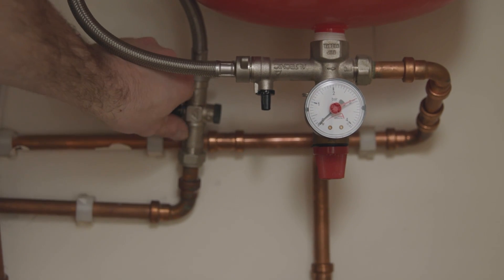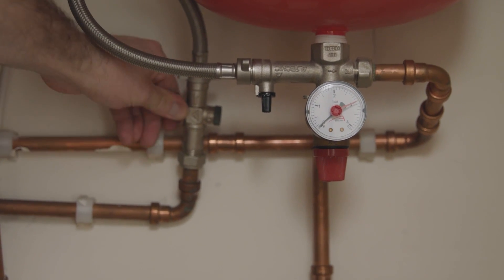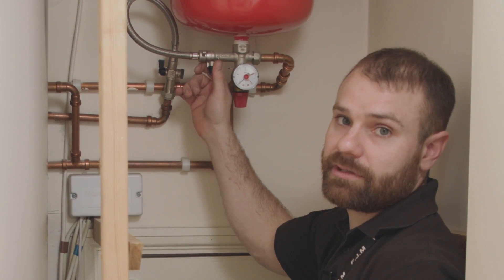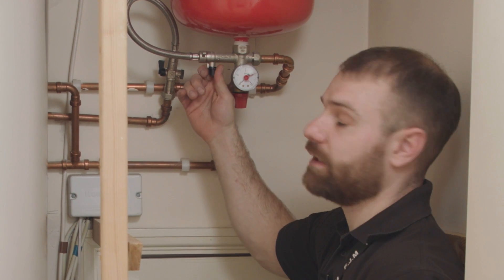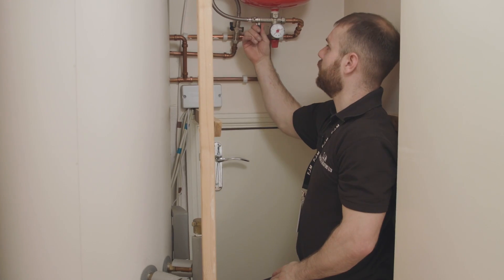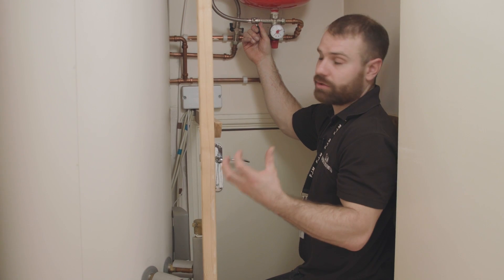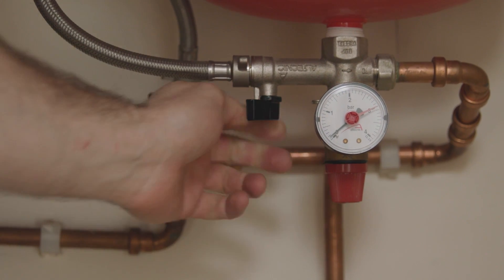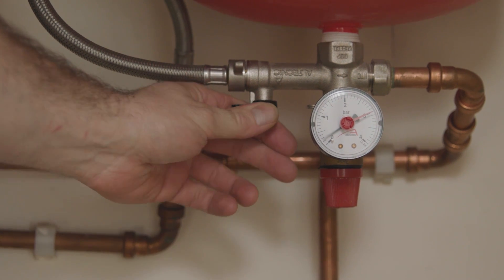In this case we have two taps — we'll turn on one and then turn on the second one. Do this slowly and do not leave the taps on; do not walk away from it. You need to stay in front of your pressure gauge. As you turn the lever you'll hear a water rushing noise — don't panic, this is perfectly normal.